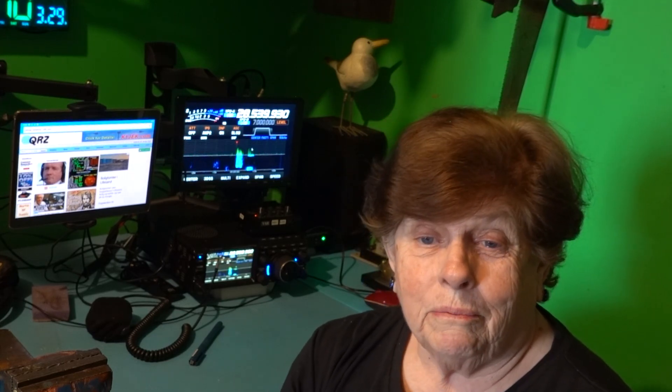You'll have to download the latest OpenGD77 CPS and two other pieces of software to flash the DM-1701 to OpenGD77. A USB programming cable for the DM-1701 is not the same one used on the UV-5R. You have to include the right programming cable in your order — it's almost impossible to program it for ham radio without the correct cable, and I didn't have one. When I ordered one it cost me about $28.